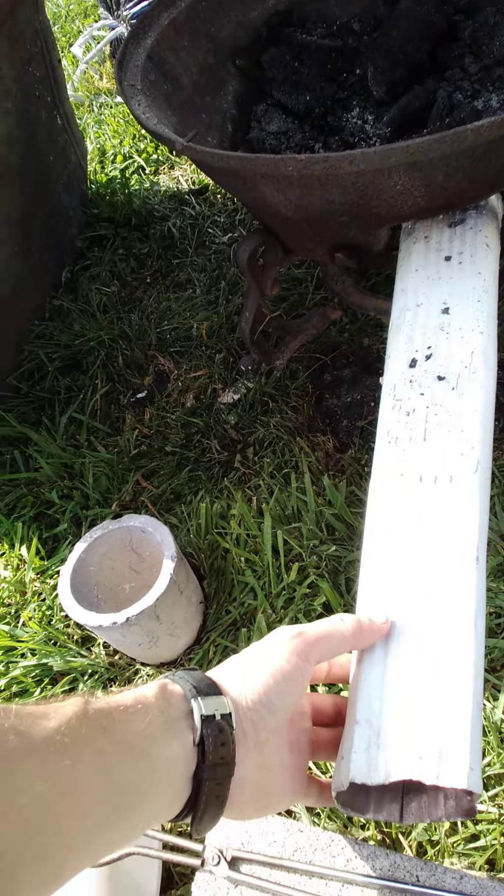We've got a crucible right here, which, as you can see, was very hot when we took it out. This is good for melting down pop cans. We just had wood — like normal wood — a small leaf blower, and a crucible in there. I'm actually really surprised and happy at how effective that was. It's impressive. And it's really good that it runs off mainly just wood, because lump charcoal is now out of season.